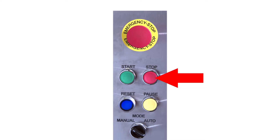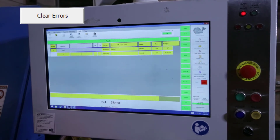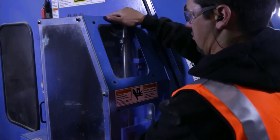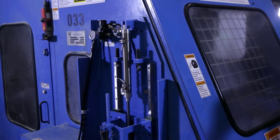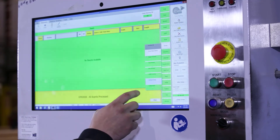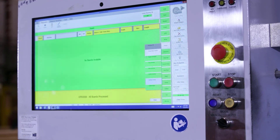From the HMI, make sure the saw blade motor is off. Place the saw in manual mode and clear all errors. Make sure all personnel are clear of the clamps. Remove the guards surrounding the clamp cylinder. Take adequate measures to prevent someone from operating the saw or clamps at this time. Press the clamp status indicator on the blade home screen — this will open the clamp menu. From there, press the appropriate clamp button to open or close the clamp in question.